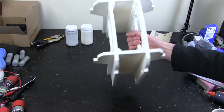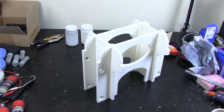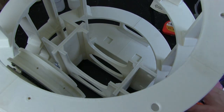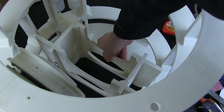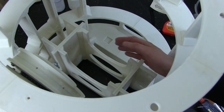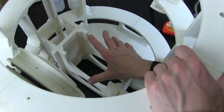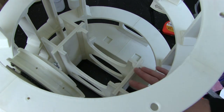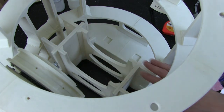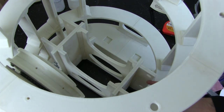Here's the completed piece for the center foot mounting - the complete grid with the eight curved pieces that lock into the chassis. This is seated right in the bottom there - it's going to raise up on a rail which will be back and front on rollers, and when it drops in it homes right into the bottom which means it's incredibly stable front to back and left and right. There's a little bit of wobble but that's going to be fine - when it's pushed into the bottom with the center foot mounted on it, it won't wobble around at all. I need to put some rollers at the back and front, and I've got the bearing holes in here - four of them, two at the back and two at the front - to run on rails which are basically going to be very straight strips with a T-piece.